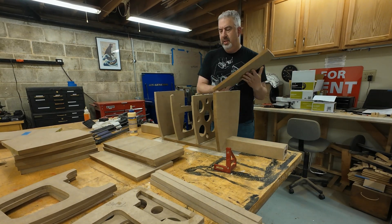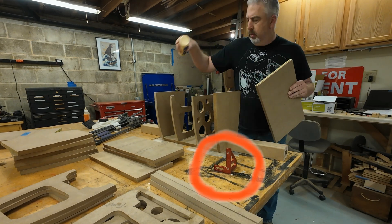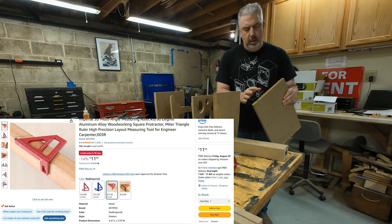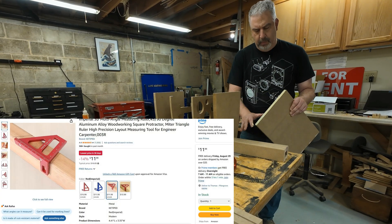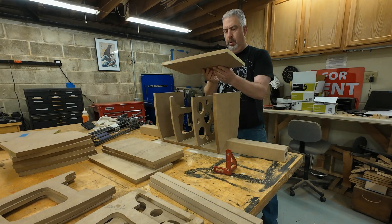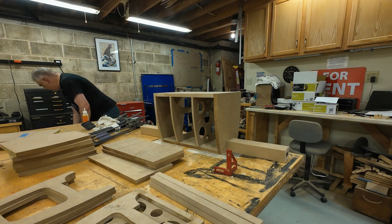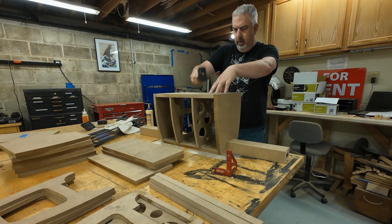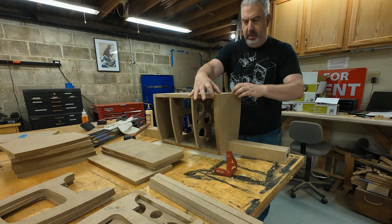The red thing you see there is a smallish square tool I purchased from Amazon. It keeps square in three dimensions and it's small so it's handy for truing up a glue-up as you go along. You want to make sure that your panels are perfectly parallel and perpendicular. You don't want your speakers italicized, right? Let's leave that for the letters.